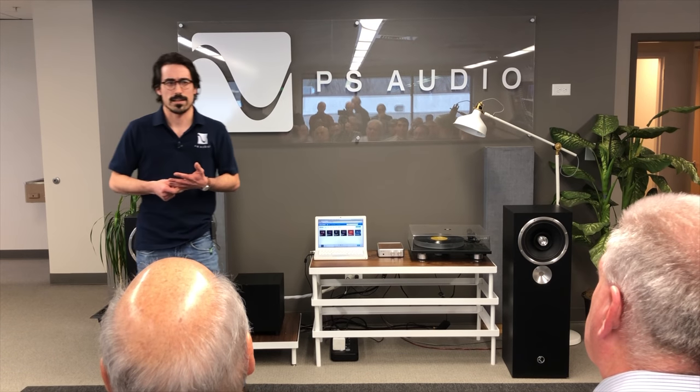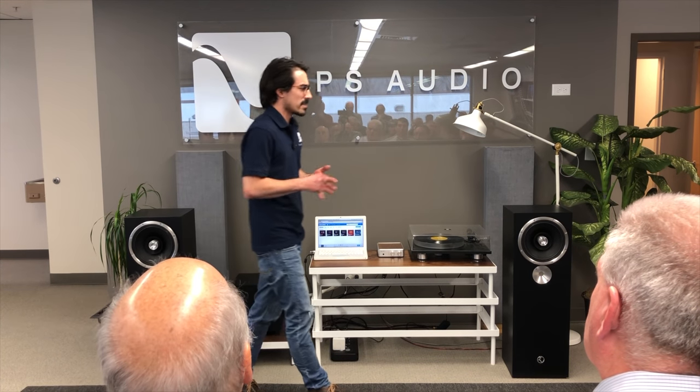So my open loop performance is really, really great. I do that through biasing stages really hot. So there's going to be heat coming off this thing, right? Because I'm running all class A, I'm running high currents, and I'm making sure that the loads are really high impedance, so I don't have that much nonlinearity. And so that's my direction with Stellar Phono, to focus on the signal path, to create something that's really linear, and hopefully get to that one note kind of outcome.